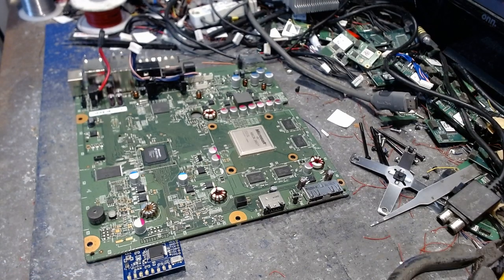For the Corona models, he has various timing files that I've been testing. Number 86 has been the good one for the Coronas, which boots every time, no matter what. So I've been using 86 on the Corona. But of course, I have to use the oscillator on the chip. Now, depending upon the crystal, and it comes from China, all of this stuff comes from China, so let's face it, not everything is perfect.